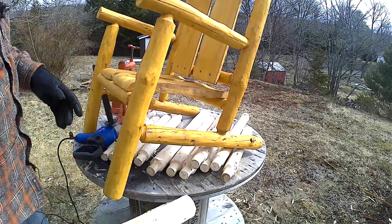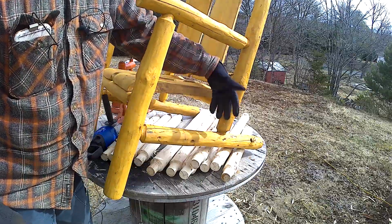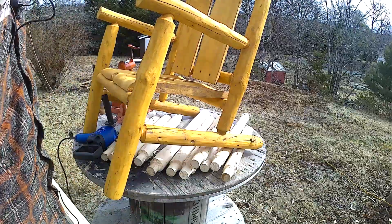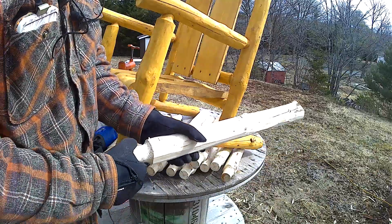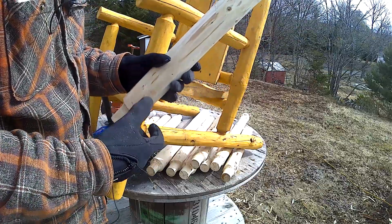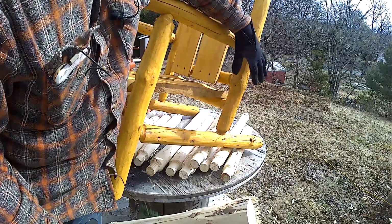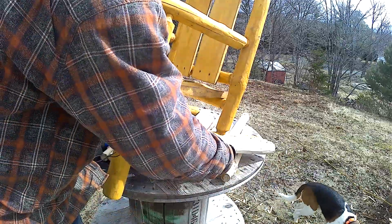Angles that I was talking about, we've got our square here, so the angles are 90 degrees, so the holes are just drilled straight in. Easy breezy, right? So this is a back leg here, and when I was measuring other chairs, some of the measurements and the angles were fairly convoluted and hard to remember, but this one's pretty easy. So all the angles are 90 for this side piece, and the measurements are 20 inches, 30 inches, 25 inches, and 27 inches. This one here.